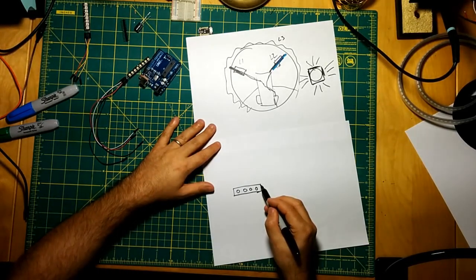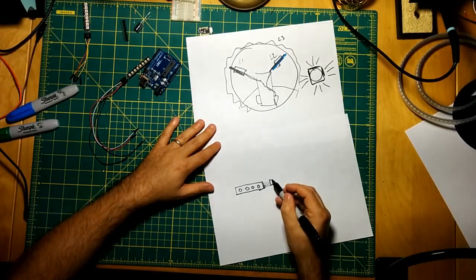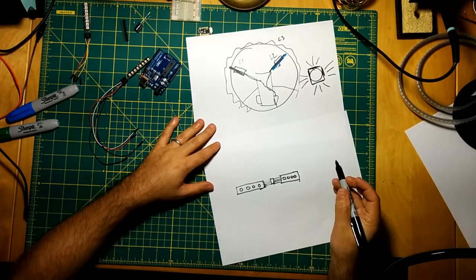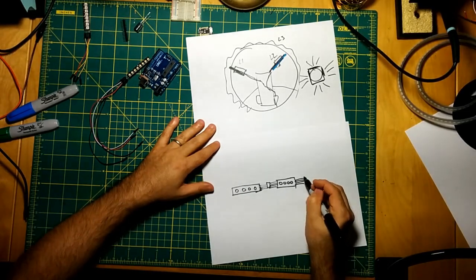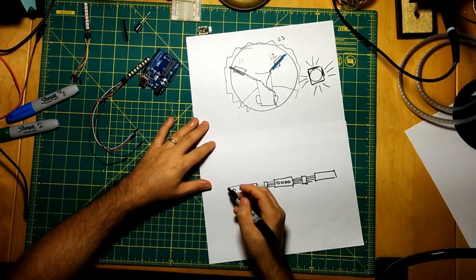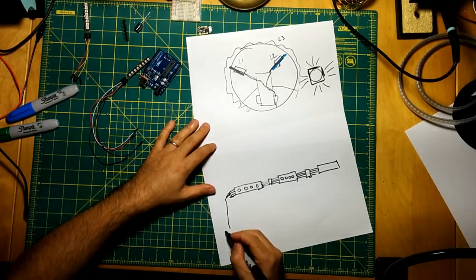We could make some sort of pigtail effectively that came off of here, and then this would be a JST connection to another strand. And then the idea is you would be able to do this indefinitely for whatever made sense for your motor, right? So let's say this is going to the battery, or this is going to the controller, and then this is your controller box.